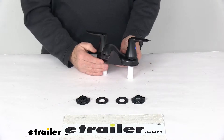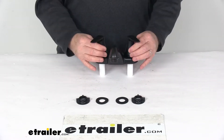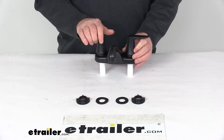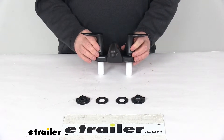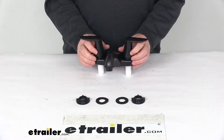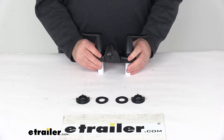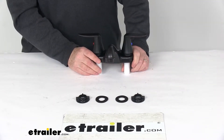This Catalina series faucet will let you upgrade your bathroom faucet in your RV or camper. It is a dual handle design with the lever style handles, and what's nice is they use a quarter turn cartridge stem, which enables the faucet to fully turn on and off with just a quarter of a turn. They are a washerless design, so it does reduce friction and daily wear for long lasting durability.